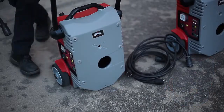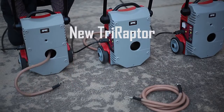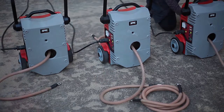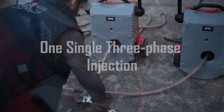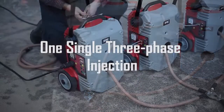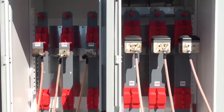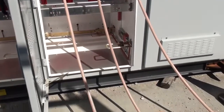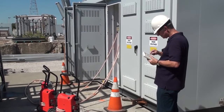In combination with its unmatched portability, the Tri Raptor allows the job to be accomplished by a single person quickly and easily. You only need to connect each output to one end of the three circuit phases, make a common return at the opposite end, and enter the value of the test current, usually within the range of 1000 amperes. By selecting slightly different current values for each phase, you will be able to easily assess consistency in the secondary circuit connections.